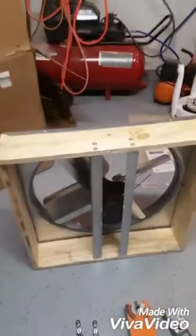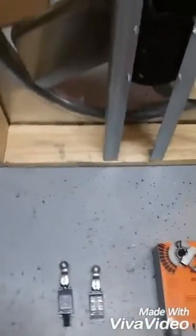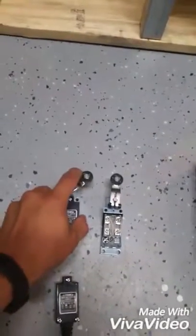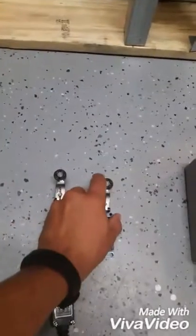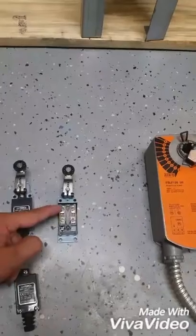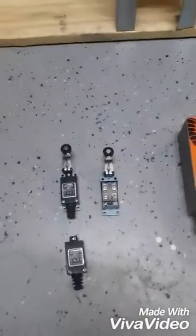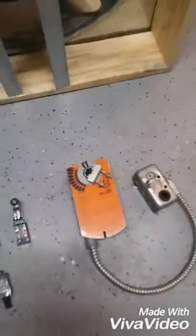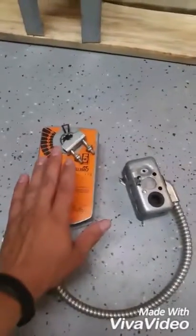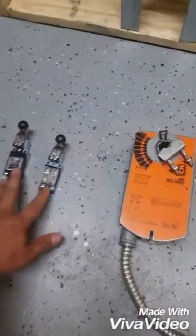What I've got is the whole house fan — it's about 4800 CFM, got it on Amazon for about $150. I've got these actuators here; they turn on and off. I've got one for high speed and one for low speed, two different terminals. You can use it on or off depending on what you want to do. I've also got a fire damper opener — they're on eBay for 50 bucks, but these were $6 a piece on Amazon.